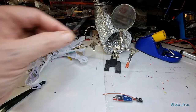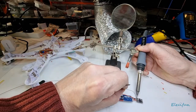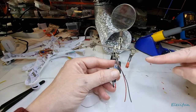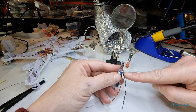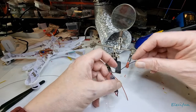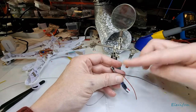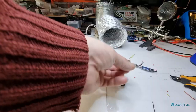What you don't want to do is feed back the video transmitter's ground from a long way away — keep it as close to the source as you can. And don't daisy-chain the camera ground off the video transmitter, because you're going to get noise. You want them to have their own separate ground paths back without picking up noise from each other.